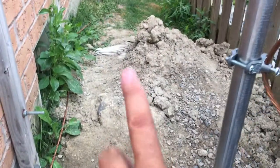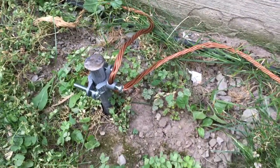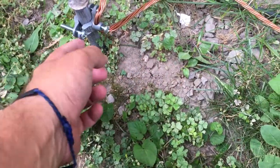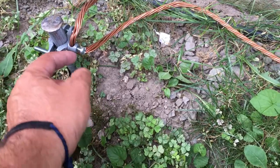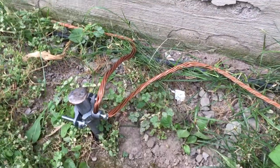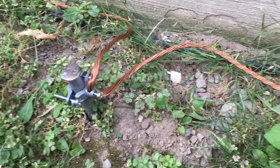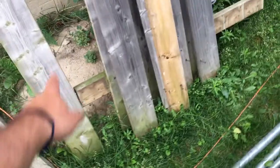I'm going to remove all the soil and put some grass or some plants on the side so my ground wire doesn't show. Here's another 10-foot ground rod. I didn't like the way it comes up and down — I wanted a different style. If this was pointing up and my wire kind of went straight, but I couldn't find those connectors, so it will do for now. I'm going to put another 10-foot ground rod somewhere here — measure 10 feet and pound my other rod, which is right here.